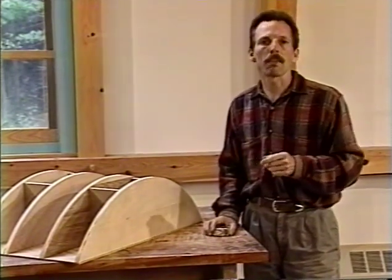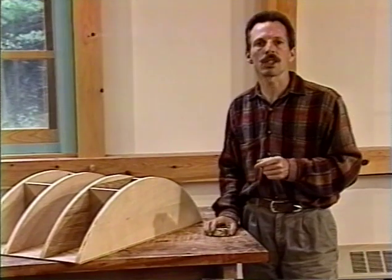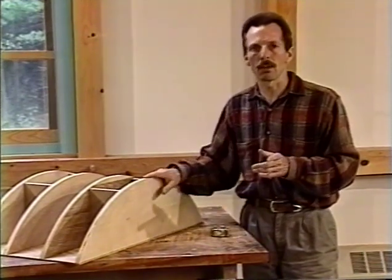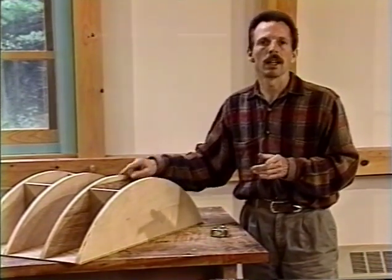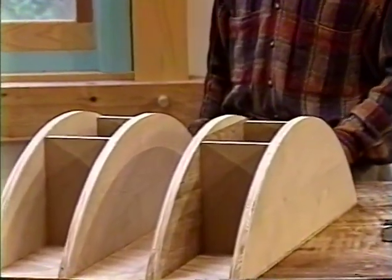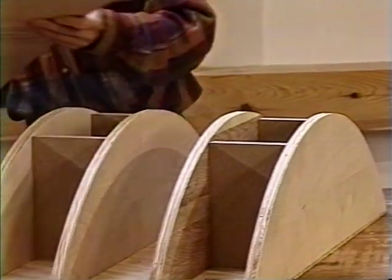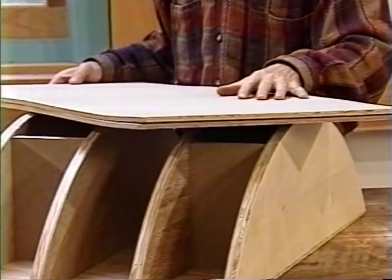These ribs I place about every 8 to 10 inches on center and are only needed between the outside rib and the next one in. It forms a sort of torsion box. Let me put these 2 layers of 3/8 bending ply on this form.